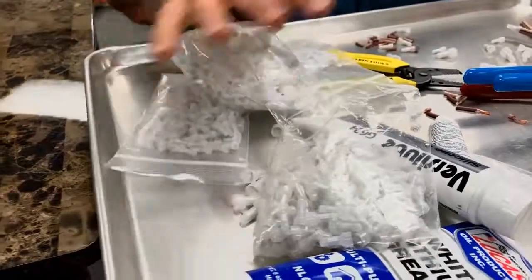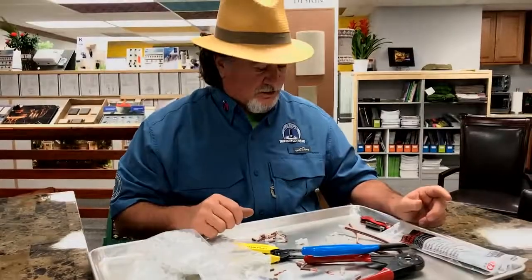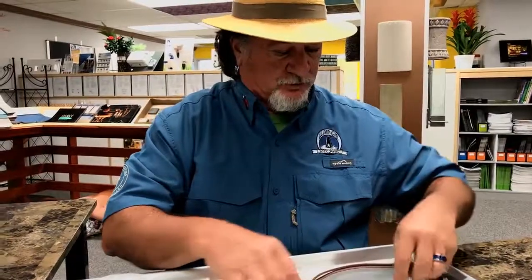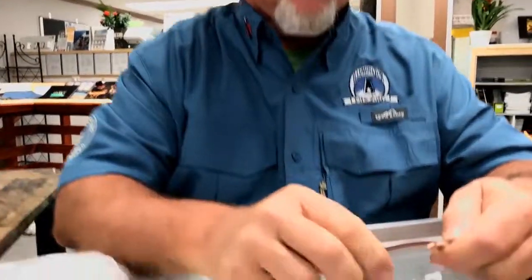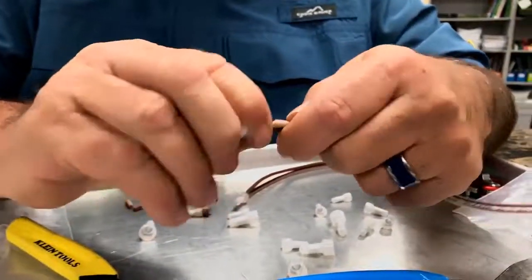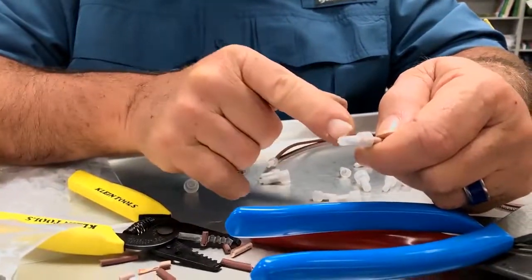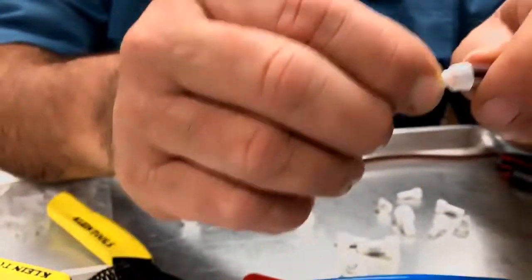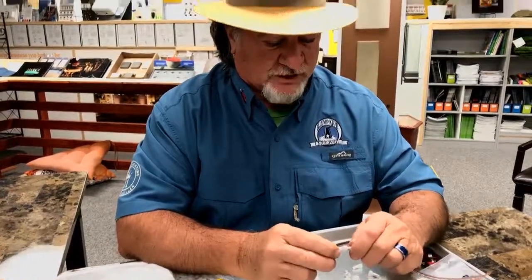When you buy 250 and above, you will get a tube of grease in the kit. Let me recap real quick: if you did not strip the wire far enough and you try to stick it into the connector, you'll notice that the wire is not all the way down. When you crimp it, the insulation is blocking it in the upper capsule, disallowing the copper to go all the way down. That's going to be a problem in the future, so you do not want to do that.